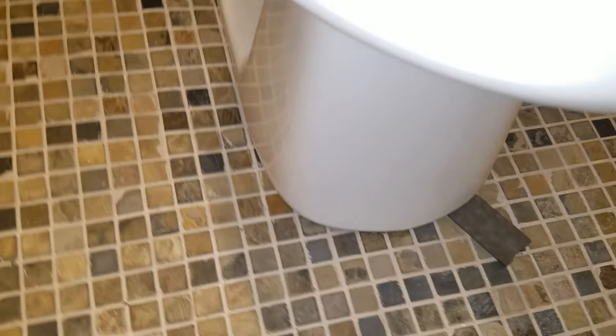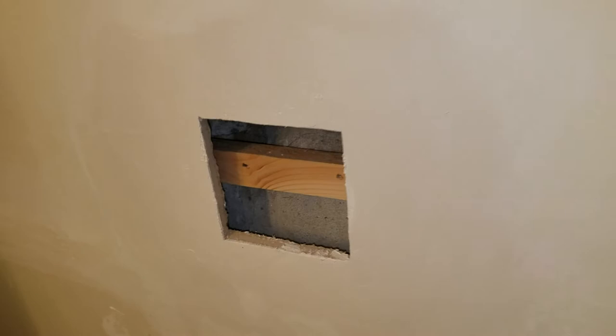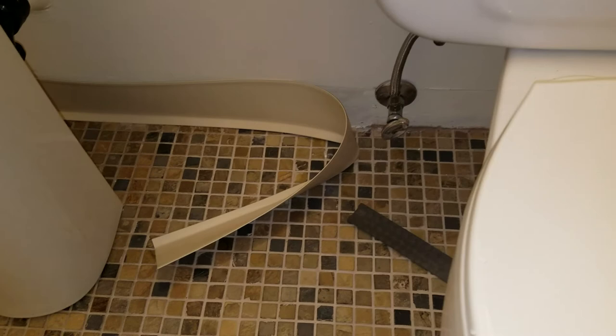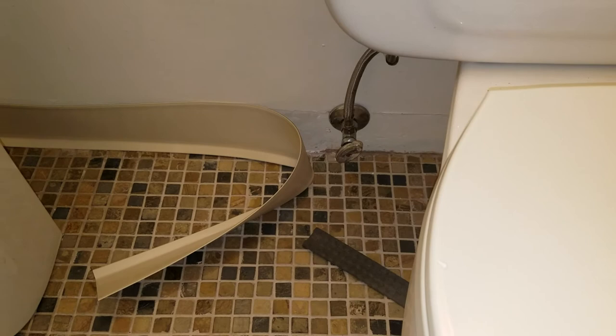So that is the hot ticket right now: putting in a recessed toilet paper roll holder, fixing the wall, getting ready to paint it. The last step is I'm just going to put these vinyl base cove base shoe moldings in — they just glue on. I've got to cut this one to fit underneath the escutcheon for the toilet water fill, and then I'll be done. There's your hot tip for the day. Thanks for watching — don't forget to like, subscribe, leave a comment and all that good stuff.